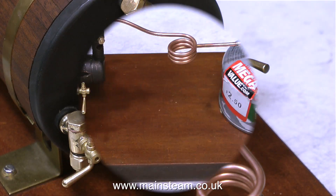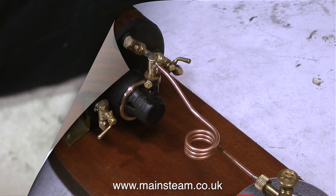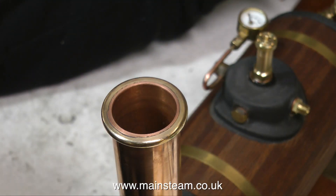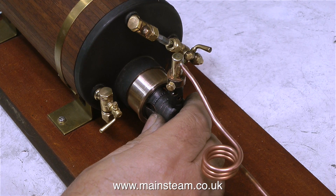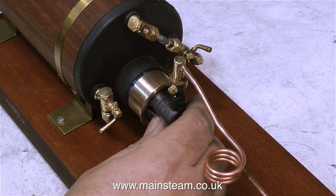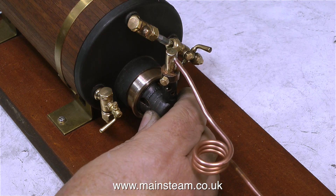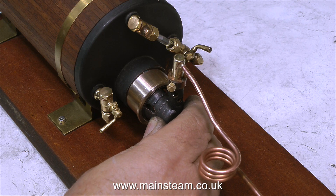The size of jet fitted to this burner is a number 8, and that's the one I've found to be the best. As you can see, it's connected to a little gas tank. What I have to do is simultaneously turn on the gas and hold an igniter over the chimney. You saw it flash there, which means the burner is lit. Problem number 1 immediately occurs - the howling. If I withdraw the burner, it stops; if I push the burner back into the flue tube, it starts again. And before lots of kind people get on the keyboards and tell me why it's howling and how to fix it, I do know how to fix it - but this is not the point.